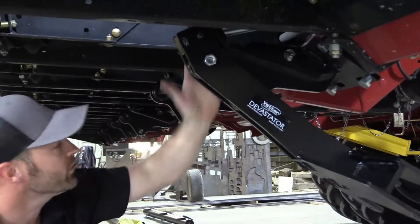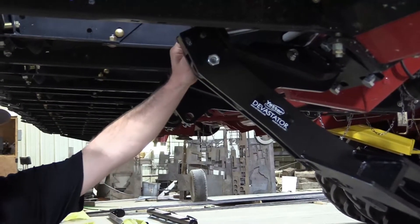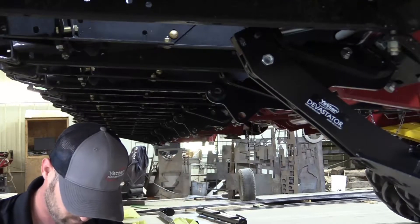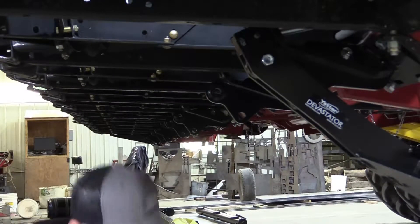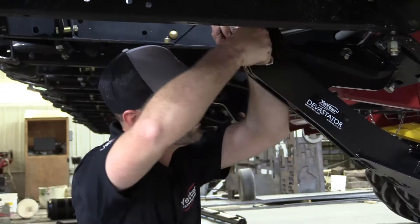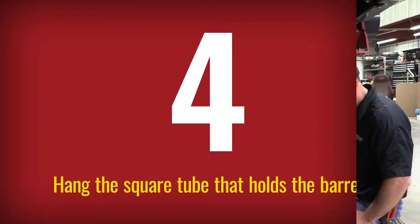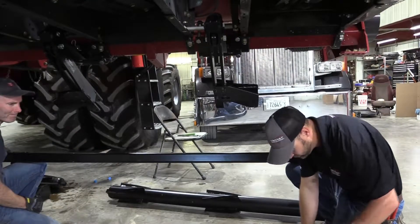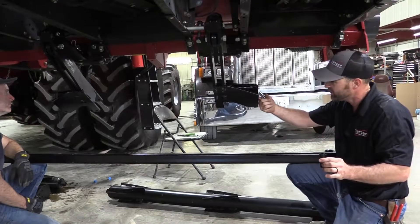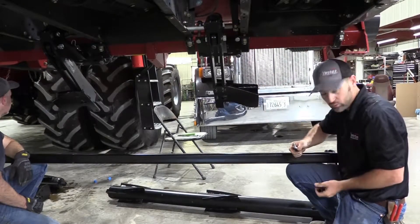Then it is captured with a half inch jam nut. This nut, you do not want it tight — you should have it snug, but it should still be loose enough that you can spin the bolt in that cavity. The next step is to hang the square tube that holds the barrel. There will be a bolt bag with two half inch bolts and a spacer. Put that square tube up into the arm — the spacer goes in between the two steel plates on that arm, and the bolts will hold it.